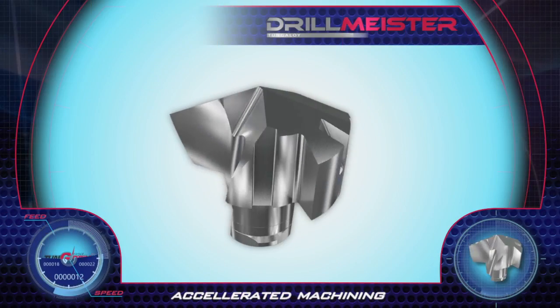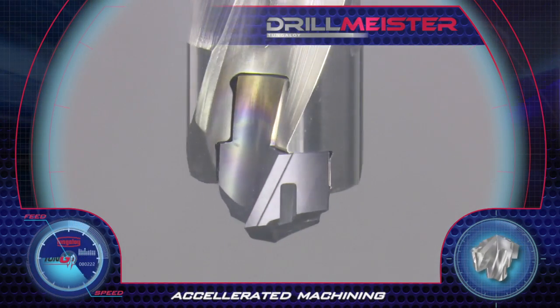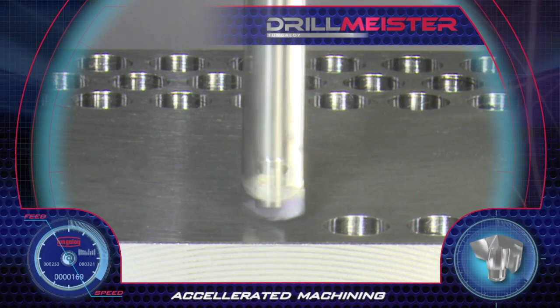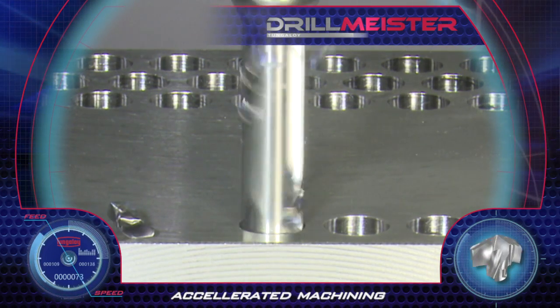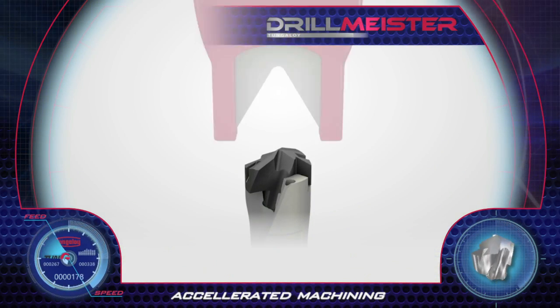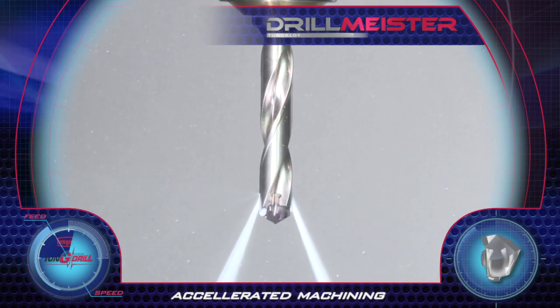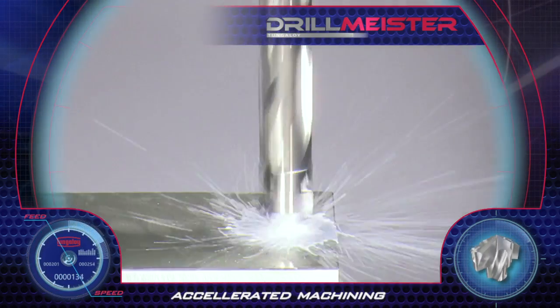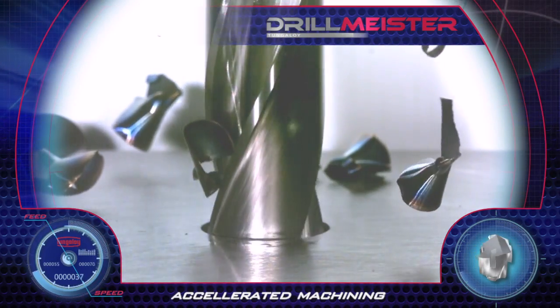Drillmeister. Drillmeister introduces a revolutionary head with 2 effective cutting edges and a no setup time clamping system. This system performs under high cutting conditions with excellent chip evacuation. The easy head replacement can be done on the machine, effectively reducing downtime. The drill body features coolant flushing throughout twisted holes with high efficiency, prolonging tool body and insert life.